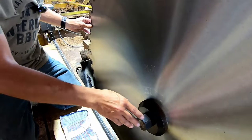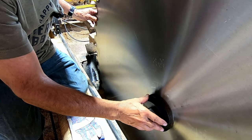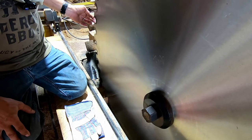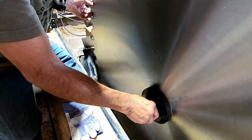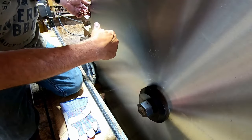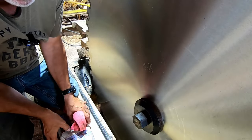Let go there, Eddie. Go ahead. Okay, now you can see the movement forward and reverse? You want to load the blade. So in other words, if the shear pins have to take over, it's engaged. If you do it the other way and it hits something, that blade is going to get inertia and it will snap those pins very easily. So that takes care of that.